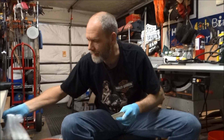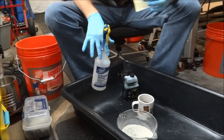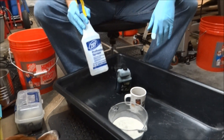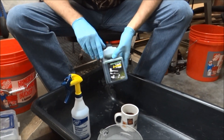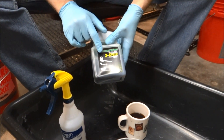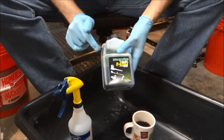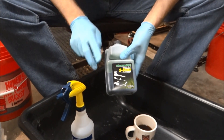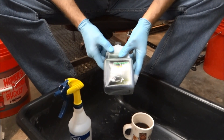This is perfect, so we're going to use that. And then you're going to need a very, very little bit of water — I'm talking about two tablespoons of water for this batch. I put it in a spray bottle; it helps for some even spraying. When it is done and you do it right, instead of using water you would use synthetic two-cycle motor oil instead. Motor oil makes for better green sand. Get it? Green — but it's not green, so stay tuned for the first step.